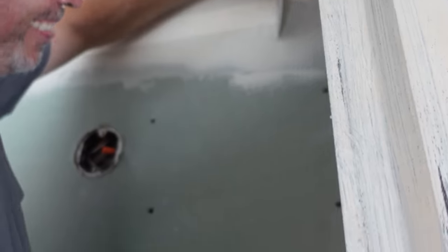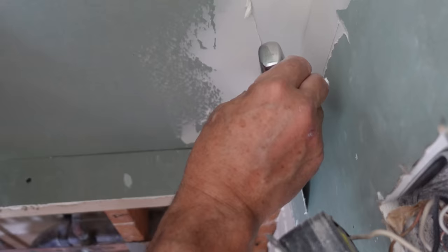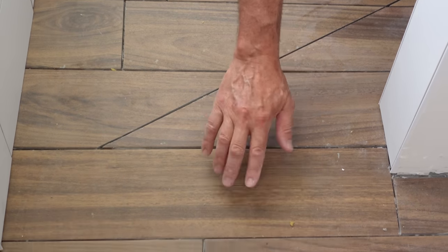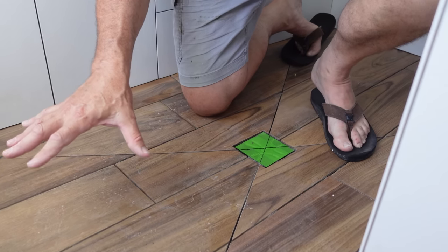Jordan and Rad are doing the last wall in the shower while I finish mudding. All the wall tiles are done — they look fantastic. Can't wait to see it with grout in it; the white grout is going to make it pop even more. But what we don't see a lot of is integrated shower floor tile — where the tile in the shower just flows naturally right out into the floor tile of the main bathroom. This tile is sloped to the drain, this one sloped a little bit back to account for the high spot, and then all that is perfectly flat. We see this all the time in high-dollar custom homes, but not everywhere else because there are a lot of tips and tricks and details you've got to get absolutely right. We ordered everything — all the tile, the Schluter system, the valve, the toilet — about two months ago. Those Schluter pans are preformed at the factory to slope towards the drain, so you get good drainage. We love them because they save us a huge step in the dry pack and waterproofing — it already comes waterproof, you just set the drain and you're ready to go.